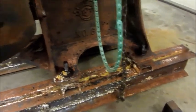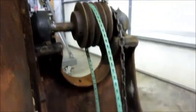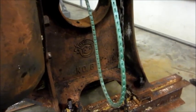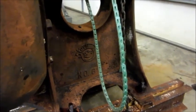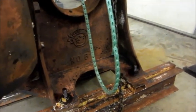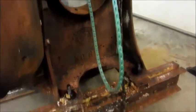My next step is to take these bolts off, get the blower frame off the skid, and get it modified. The motor has been running all day since this morning, getting quieter and drawing less current as the new grease distributes. If that winding had a turn-to-turn short it would have made itself known by now. I'm pretty confident the motor's going to be okay, and it's definitely adequately powerful to drive this blower even with the VFD on 110-volt input.